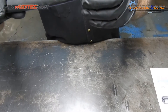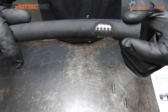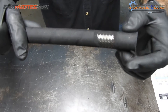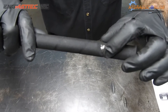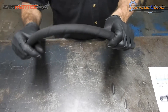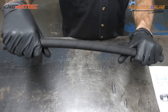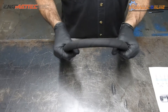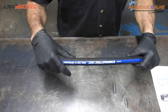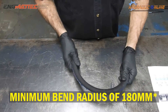Two-wire means it's actually reinforced with two layers of high tensile braided wire. There are two layers of this wire. So this half-inch hose is rated to 4,000 psi continuous pressure, or 276 bar. It has a minimum burst pressure of 16,000 psi, or 1,100 bar, and it has a minimum bend radius of 7 inches.